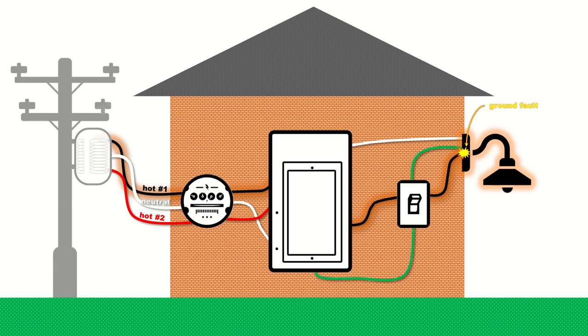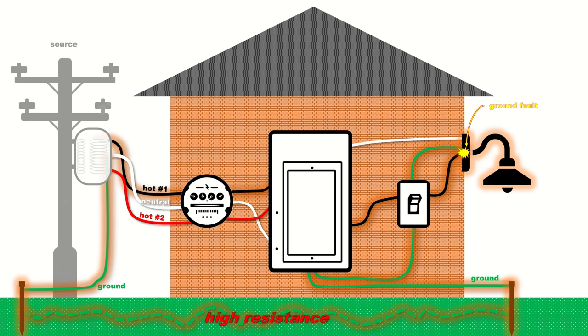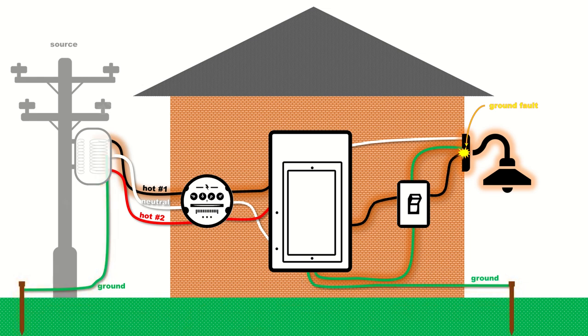A properly installed grounding system will allow electricity to flow through the ground wire when a short circuit occurs. While this ground wire runs from the main service panel to a ground rod buried outside, the ground rod isn't really used for ground faults, as the electricity will try to return to its source rather than just going into the earth. Even with a ground rod connected to the neutral at the transformer providing a potential return path, the path through the ground will have a very high resistance or high impedance. Since electricity follows the path of least resistance, it would look for an easier path to follow. The purpose of the ground rod is to dissipate static electricity and external high voltages like lightning strikes.